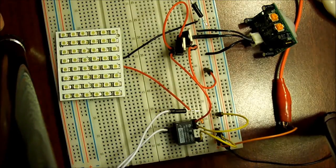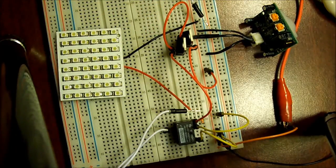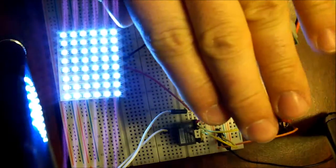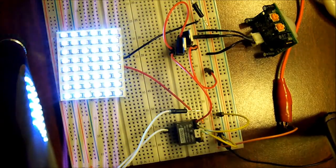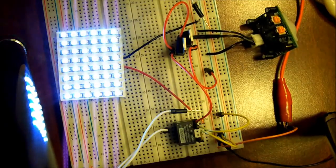It's just working just enough to energize the coil, but that's it. If I had a 5 volt source going into this Darlington pair, it would put them into full switch mode and I could be getting all the current I wanted — more than enough to do anything, at least inside these tiny little integrated circuits. The PIR is shooting at 180 degrees, I believe, is what the spec is. So all I have to do is really get above it; it's pointed down, or at least parallel to the table.